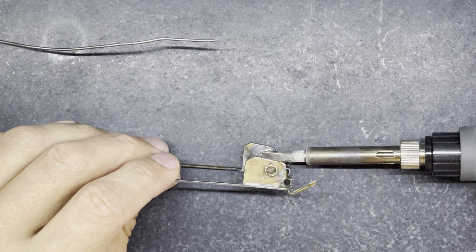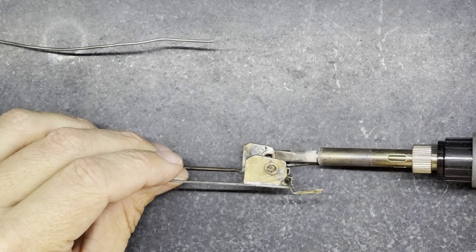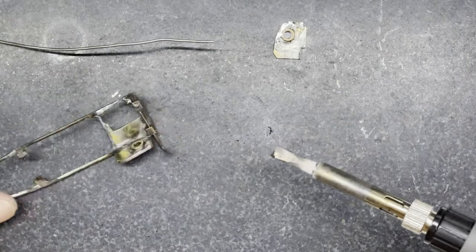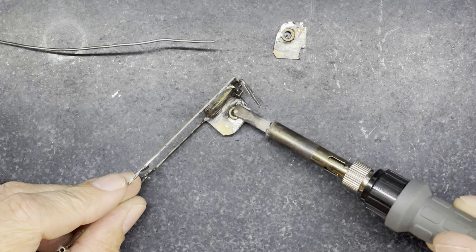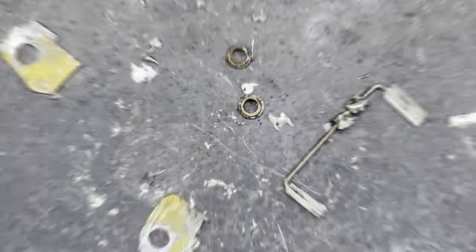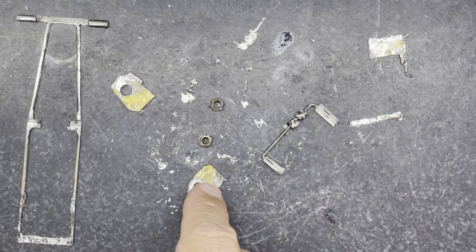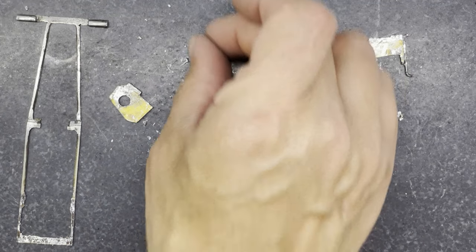Just by heating it up - there's quite a lot of brass here to heat up, but here we go. I'm going to take the whole lot off because I'm not happy with the alignment of it all either. I got a bit fed up with it really - I couldn't leave it like that. Strip the whole lot down, remove those. One eternity later - what an absolute nightmare getting them out. One of these little bushes was really, really stuck in the pillar block, so I had to lever it out with quite a bit of heat, but they're out. They're pretty scrapped - they can go in the bin.